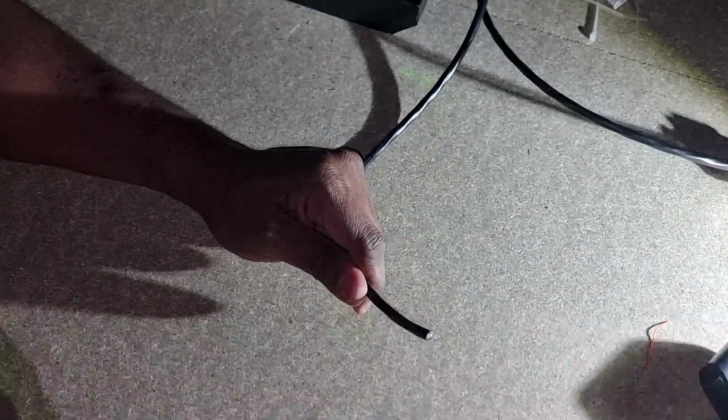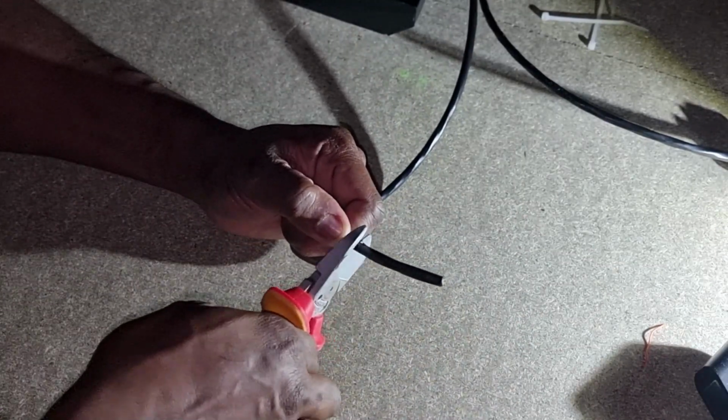And what we use in terms of our patch panel is an Emitex Cat6A 1U patch panel that we got from City Electrical Factors. We also use the Emitex Cat6A Keystone jacks. These are really good, I believe, because they are solid, they are shielded, and we only use Cat6 cabling throughout our installations. This is because we believe in installing for the future rather than the past, so you can have faster speeds on your network when those faster speeds become available.